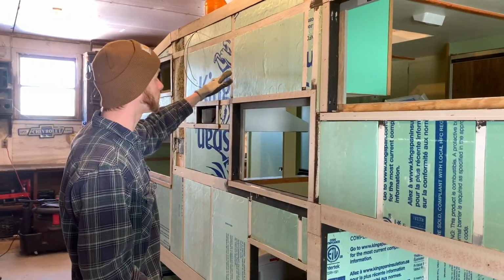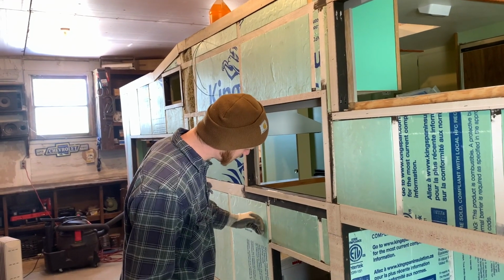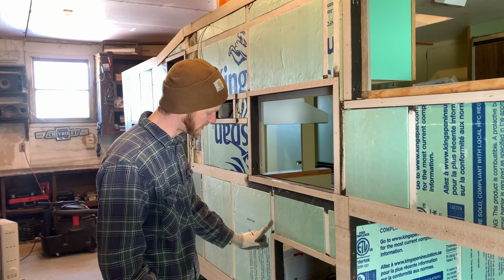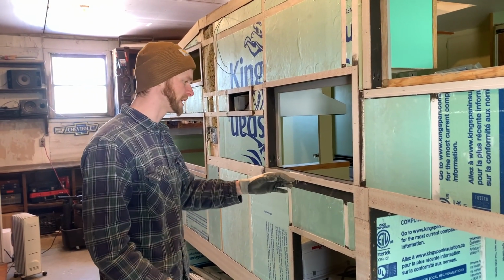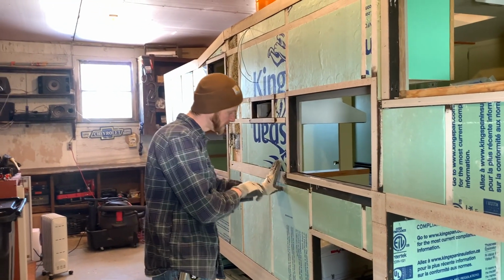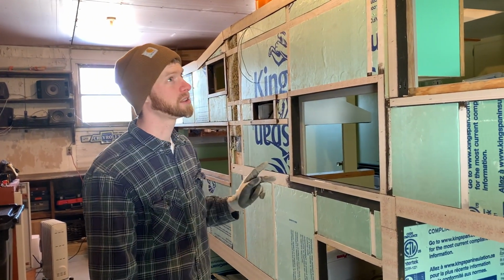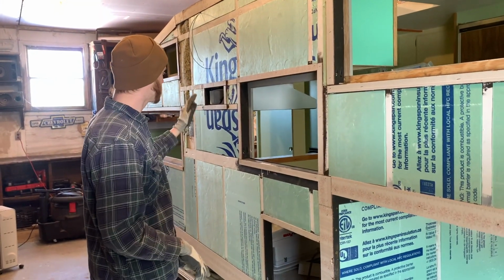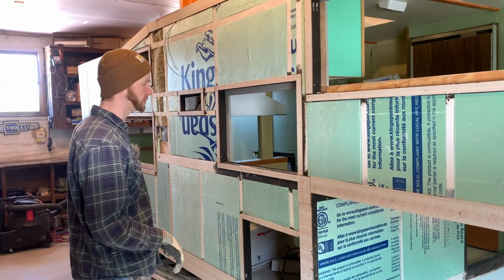There you go. Okay. The first reason is the insulation thickness. This hard paneling insulation, foam board insulation, sticks out a little bit higher than the studs because of the dimensions they are. So I have to build it out on the studs so that when the aluminum goes on here, it doesn't shoot right through the aluminum with a gap in there. So that's one reason. The other reason is in case any of the studs are bowed in and out, you can put a shim or not put a shim in.